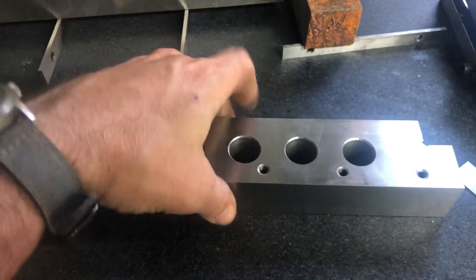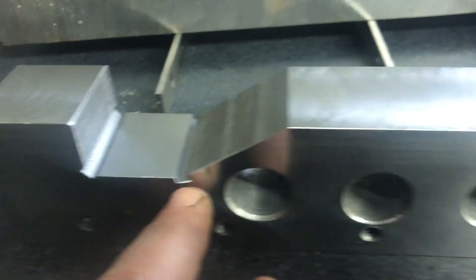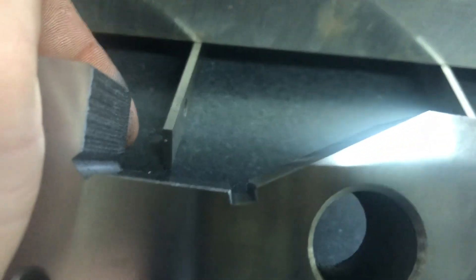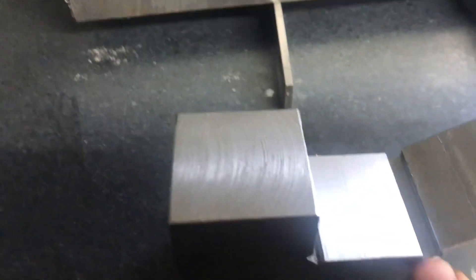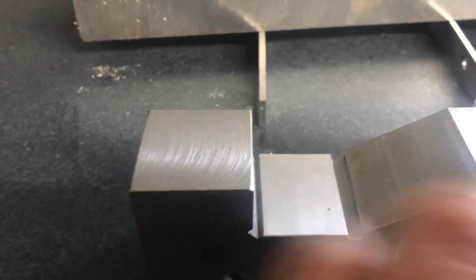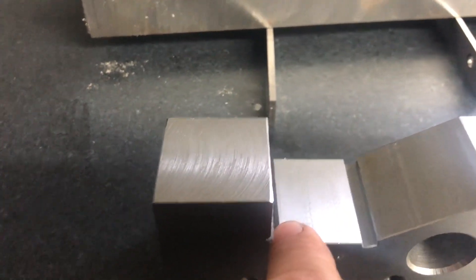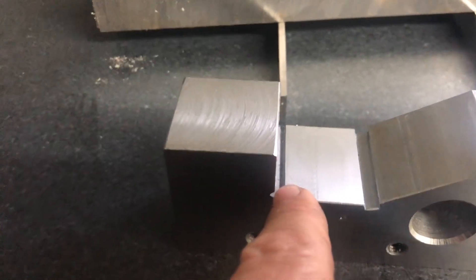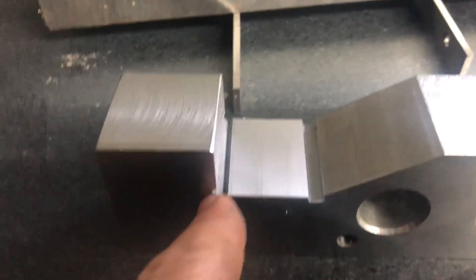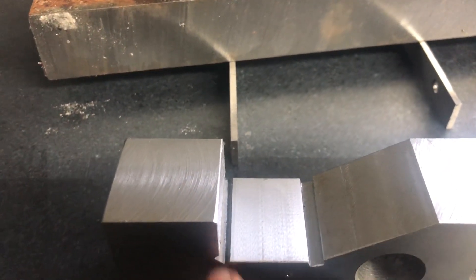Let's talk about the grinding relief. For the grinding relief I use 3/16 end mills — you can dress a wheel nice and thin and grind them in. I try to match the angle: that one's at a 15-degree angle because back slope is at 30 degrees; that one's at 45 because it's got two 90s right there. With those grinding reliefs, even if the edge of my wheel goes out midway through, I'll still make it. I see people do a nice little slitting saw cut and get super close, but in the real world I've spent a lot of time in front of a grinder. When somebody throws a piece in front of me and the edges aren't relieved, I'm like, 'Oh great, I've got to dress the wheel 30 times before I finish this piece.' That's why I do the big thick reliefs.